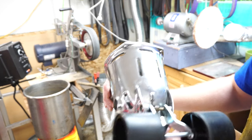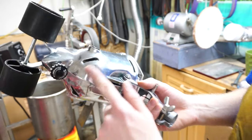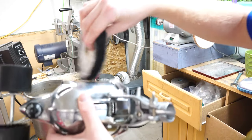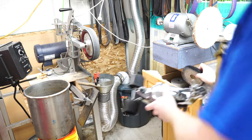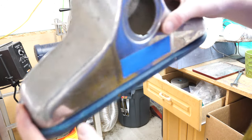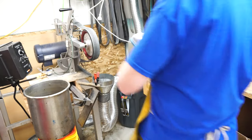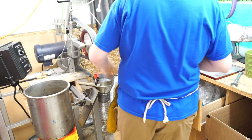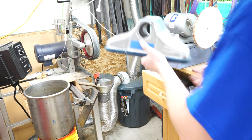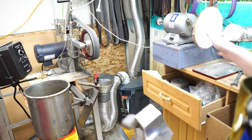We're in my grinding room in the shop. The back of this is really good — very few big scrapes — so I'll just have to polish this with a soft cotton wheel, not the cardboard wheel. But the rest is not so nice; there are some really deep gouges in here. I've started cleaning them up on one side. The process is: use a grinder to take the scratches off, then polish. The grinder right now is set up for 800 grit, and I can go up to about 10,000 grit before I have to hit the polishing wheel.